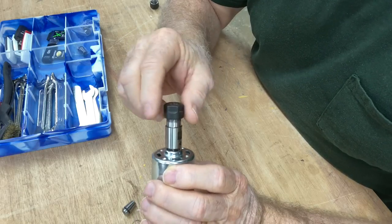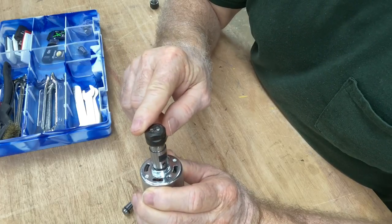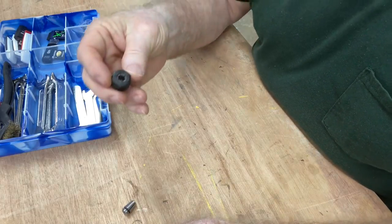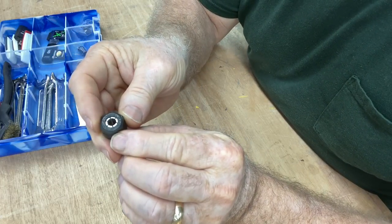For folks in the U.S. who use a quarter-inch shank on their bits, the millimeter set will not work. I have a link in the description below that will give you the link to the collets so you can put a quarter-inch in, and it will work on the spindle perfectly.